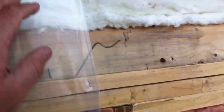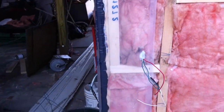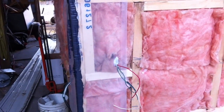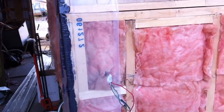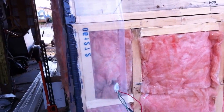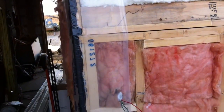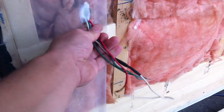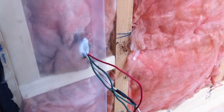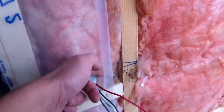You do this around all four corners. The most critical portions are obviously where there is interior siding in the corner, which is the case in most locations of the trailer. Also, make sure that wherever you punch a hole through the vapor barrier — for example for wires — you silicone those holes so water can't get in. Silicone it up so water can't get through.